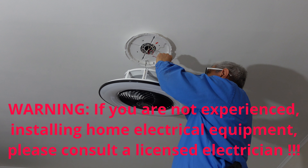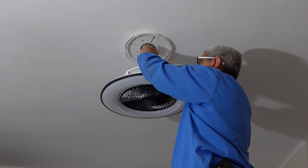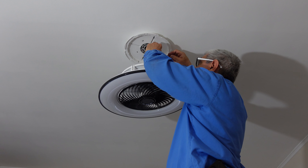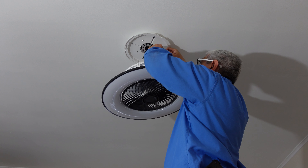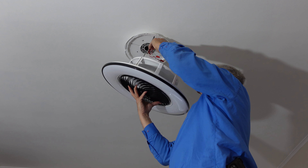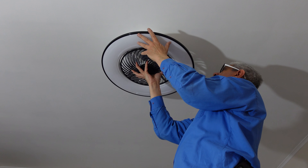Make sure you have the electric off — really careful. As tight as you can do it with your fingers. I realize why I'm having trouble — I started the wrong way; I should have done the ground first. This white wire actually has an 'N' on it to indicate neutral, as opposed to hot. The other one has an 'L' for live. It's a shame these have stranded wires — they don't connect as easily to solid. This white wire goes to neutral and we'll get it eventually. Try to hold it up while I connect the ground. The ground is connected to the box — I don't really need that, so I'll push it back up. Now that the wires are connected, I can just sort of push the whole thing up into here.